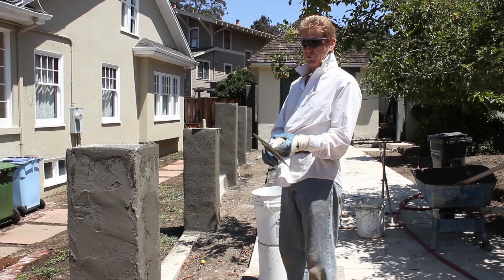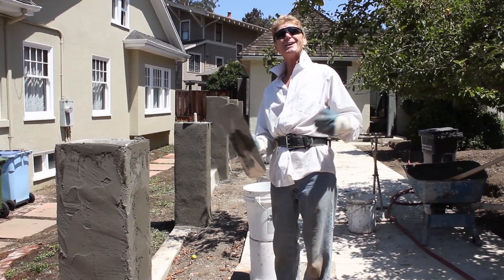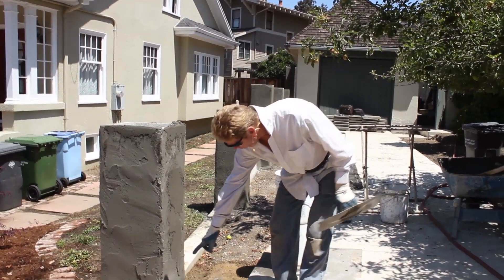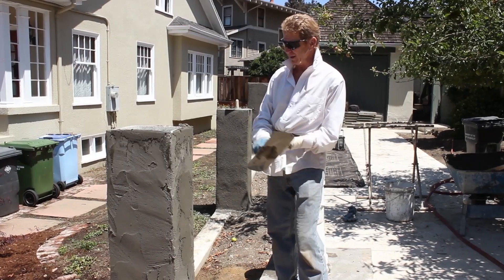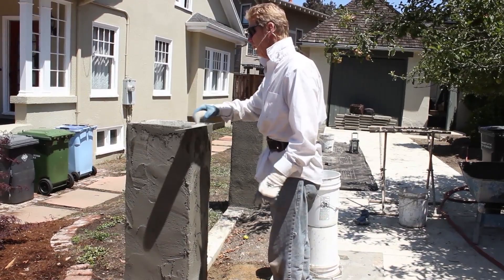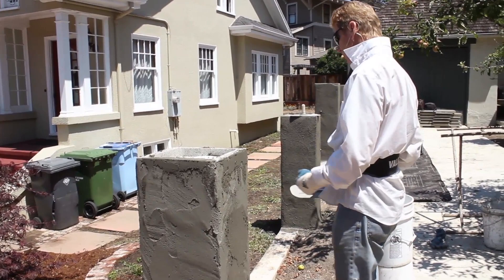It's really hot and we kind of lost it — the weather dictates what we have to do. You can see it's turning white right here, which means we've kind of lost it. Here's a tip: when you're doing blocks, brick, or anything, don't pull the plaster off the top right here, because you'll pull your own finish off. Instead, cut it like this — that way you leave the tops on. They're going to put caps on these, and I don't want big gaps.